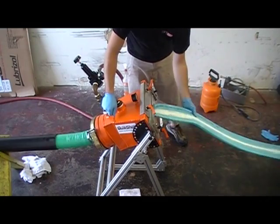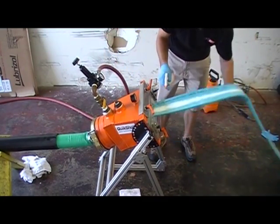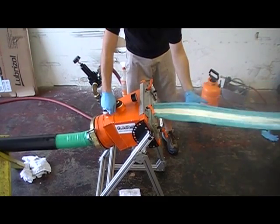It will also invert transition liners — the common two-diameter changes found between the building and the sewer main. This eliminates the need to open the pipe at the 4-inch by 6-inch transition.